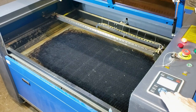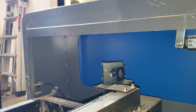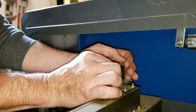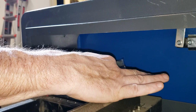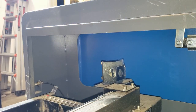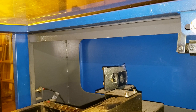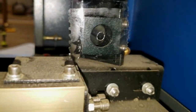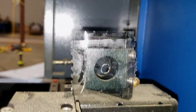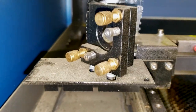For mirror number two, we move the gantry halfway and place another piece of tape over mirror number two - the mirror on the left side of the gantry looking at the laser. Quick pulse, and you can see right where the laser beam intersected with the tape. That looks pretty dead center too - this thing traveled fairly well. These are the screws you adjust if needed: three brass screws, just give them a little quarter turn.